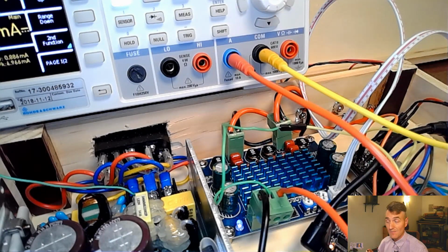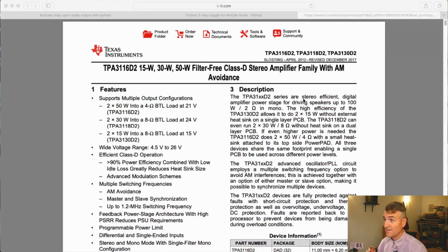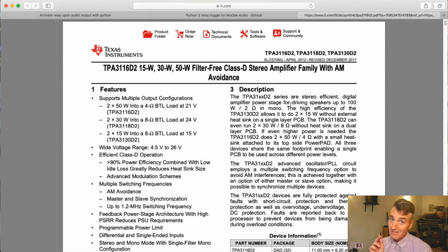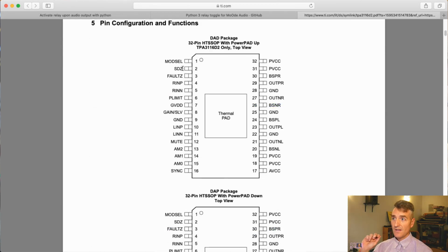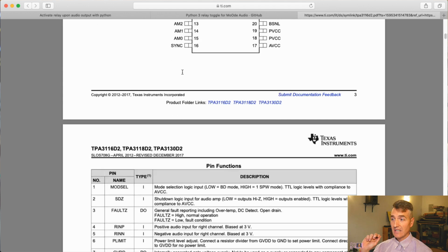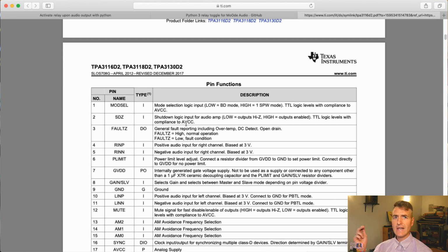And to find out a little bit more about that pin, we are going to my favorite spot, the data sheet. Don't forget the data sheet. You knew we were going to come back to the data sheet eventually. On this chip, there is a pin called standby right here, SDZ, or shutdown. On the board, it's labeled standby. In the description here, it's labeled shutdown logic input for audio amplifier. So the outputs will go to high Z when this pin is pulled low, and when this pin is sent high, it will enable the outputs.